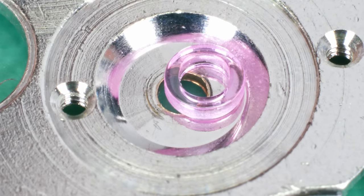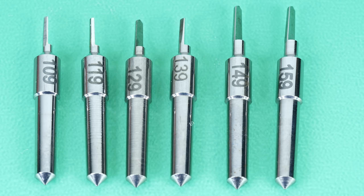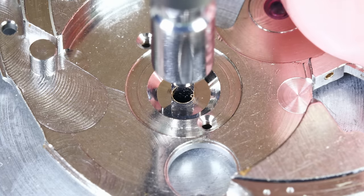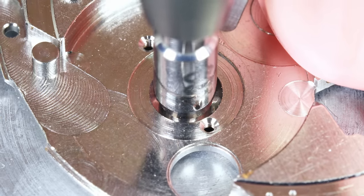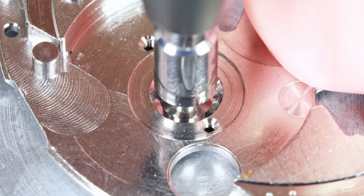The hole in the main plate is for the barrel arbor pivot. We're going to have to ream it out to make it large enough for the outer diameter of the jewel. That's done step by step — one reamer after another. You can't just barge in with the reamer you want to finish at. I'll start with the 1.09mm reamer, go one by one until I get to the 1.59mm reamer. The jewel itself is 1.6mm in diameter. This one is actually easy — it doesn't have a tenth of a millimeter to shave, so it goes in like nothing.